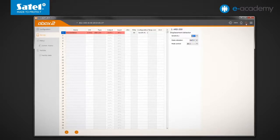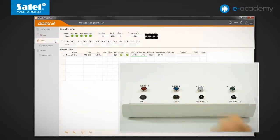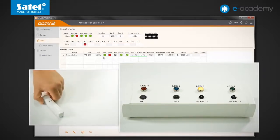I send data to the controller. In the status tab I observe how, after switching Bi-2, the detector enters the active state. The OUT3 output and LED connected to it have turned on, so detector reorientation has been detected. Restoring the initial position will end the violation.